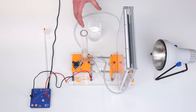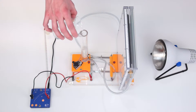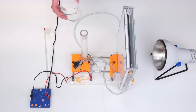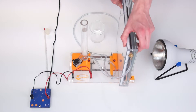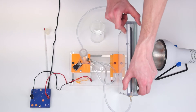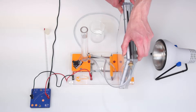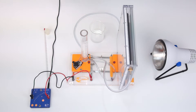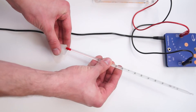With the help of the beaker we can potentially refill the water. In order to get all the air out of the circuit it is helpful to move the collector back and forth. When no more air is in circulation we stick the thermometer into the stopper and put both on the balancing container.